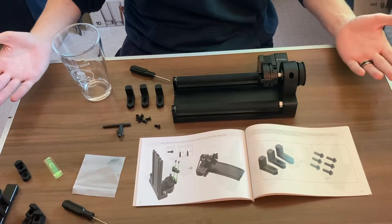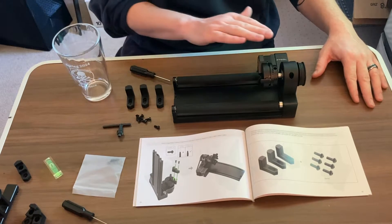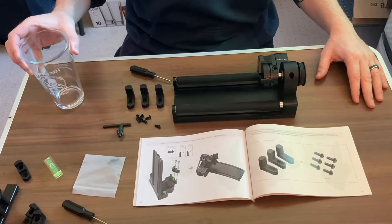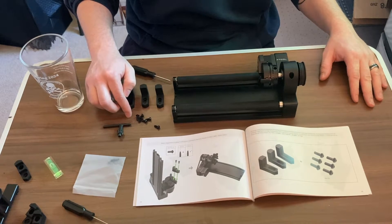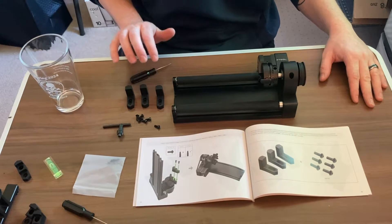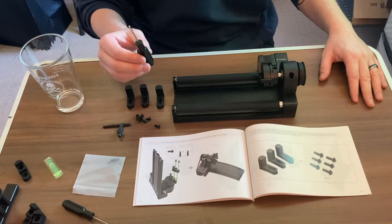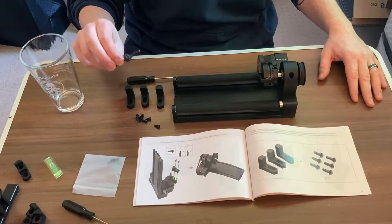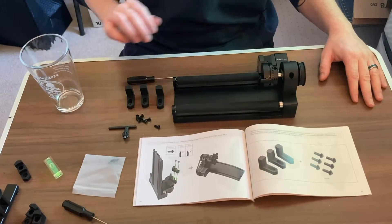For the next step, we are going to connect our single step jaw components to the rotary tool for things such as a pint glass. You're going to need your M4 by 10 bolts and your three single step jaw component pieces. You will need your 2.5 Allen driver to assemble. Your chuck key will be needed when we attach the pint glass.